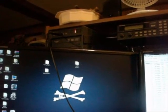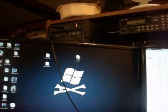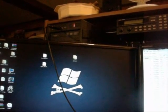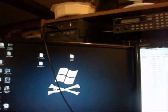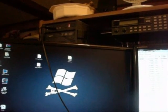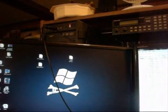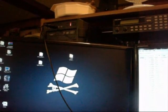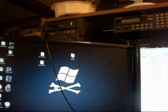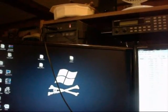When you plug this into Windows, it will automatically download the most up-to-date driver for this, and that's where your problem starts. Because Prolific did something to their drivers that makes them not work with the counterfeit chips. And if you don't use a driver that's version 3.200 or older, you're going to have problems. Because all the versions after 3.200 had the modification to keep them from working with the counterfeit chips.